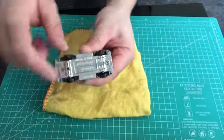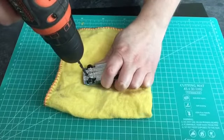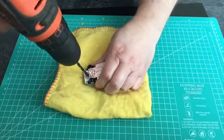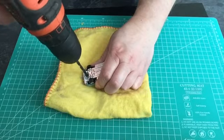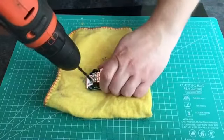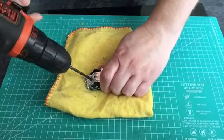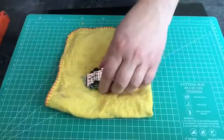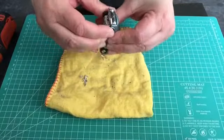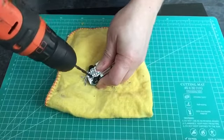The first thing we did was tackle the rivets on the bottom of the base plate — simply drill out the heads. Two heads needed drilling out, one at the front and one at the back. Carefully drill out the head, making sure you don't go down too far, as you don't know how much metal is behind the rivets. In this case I was pretty lucky — it had quite a bit of meat left. The rivets were quite well into the base, so I needed to drill the heads off a couple of times to make sure they were fully clear.